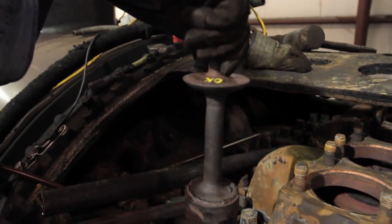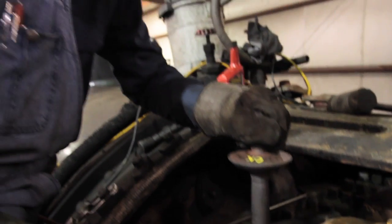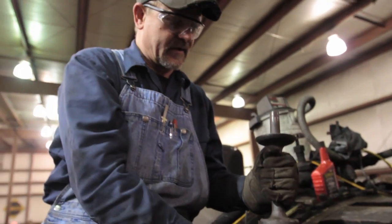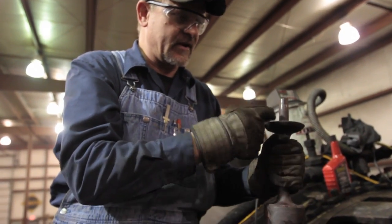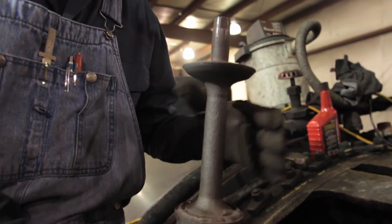This is one of the six valves. There are seven valves total including the pilot valve. And these valves, when they're lifted off the seat — when the engineer opens the throttle — this valve opens up and allows the steam pressure to go through down to the valves in the cylinder to make the engine move.